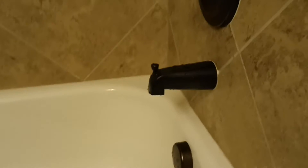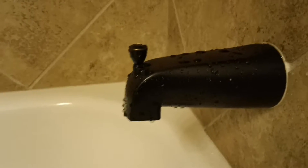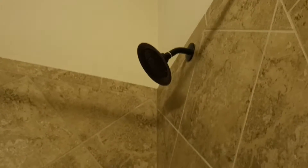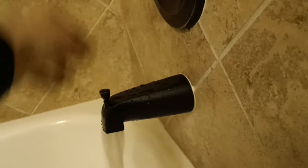What's up everybody, welcome back to How It's Done. Today we're going to show you how to fix a diverter on your tub spout that leaks water. So many people are going to have a setup similar to this, where you've got the tub with the little piece that you pull, which will divert water up to your shower head. Over time, either due to calcification buildup on the inside or due to the washer failing, you end up with a leak.